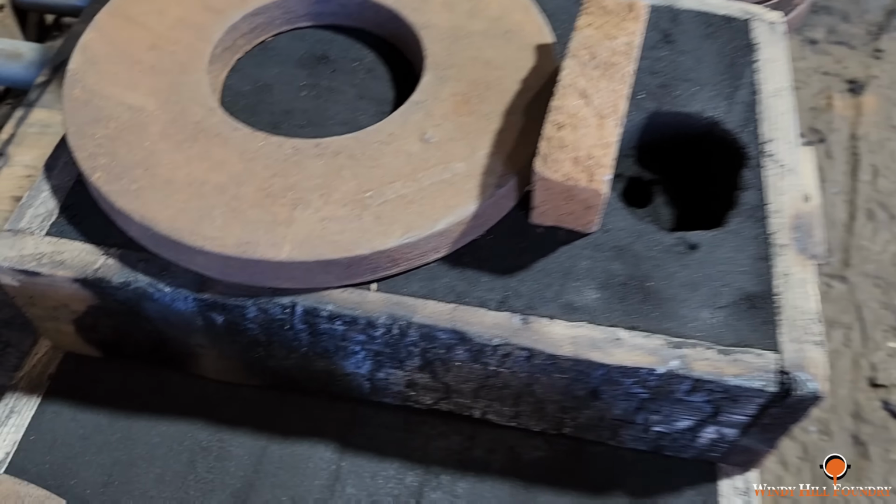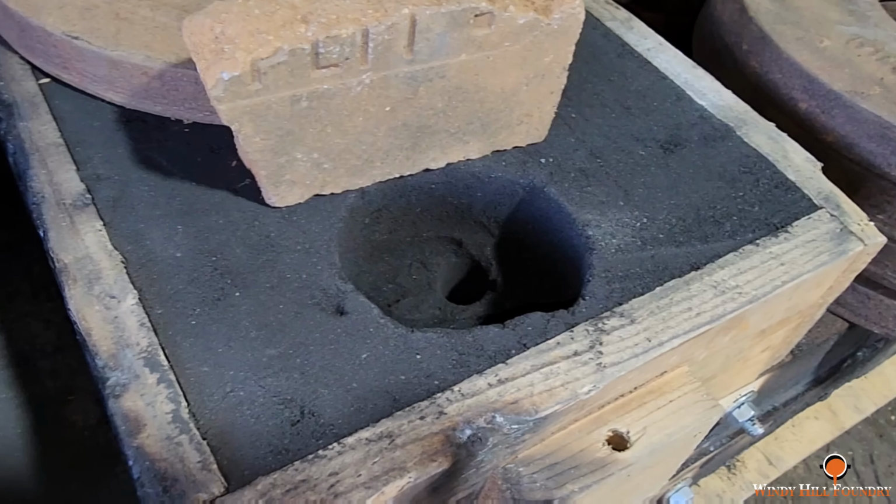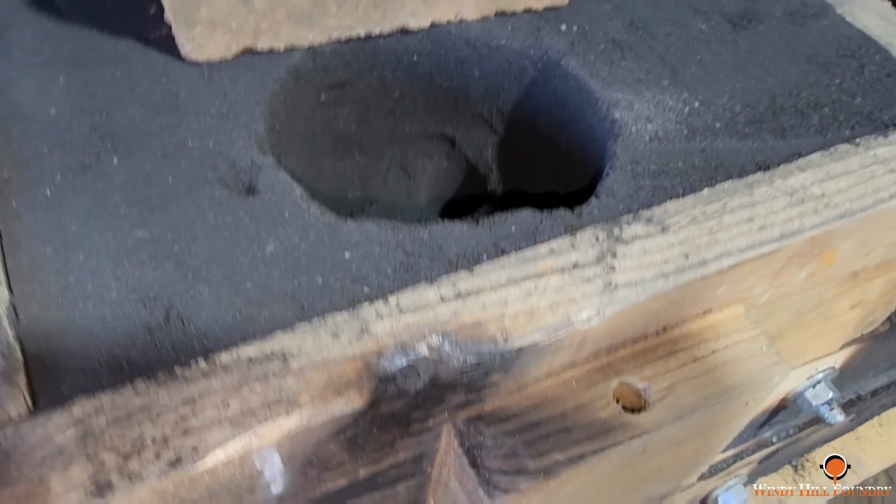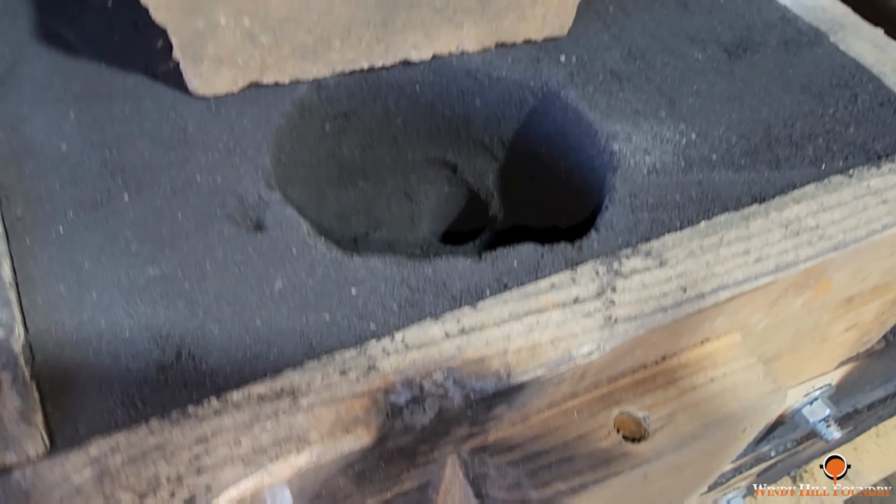With that said, since I couldn't keep the basin completely full from the first hit, it had enough time to get about midway down to somewhat of a vacuum to drag that dross down in there with it, and that not only showed inclusions in the casting, it actually stopped up a few channels of where the iron needs to flow. So I didn't get sufficient fill in that last casting. This added measure should take care of several different problems.